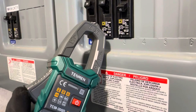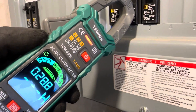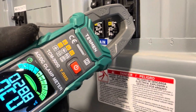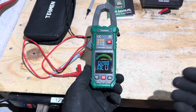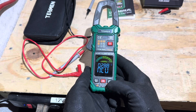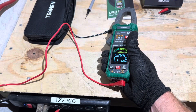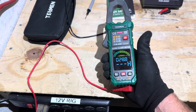Right on the breaker, it shows the high voltage indicator, and take it away — it goes away. On a dead breaker: nothing. Back to the live breaker, just demonstrating for you. If you want to use the live wire detection function, you're in the same non-contact voltage live wire menu. Just hit the select button, insert your test lead, and then you can probe for live wires — showing high voltage, just like it's supposed to.